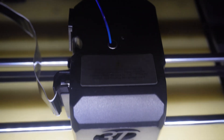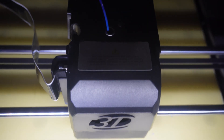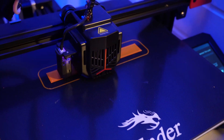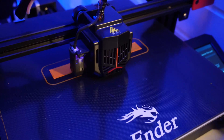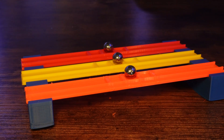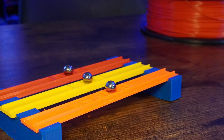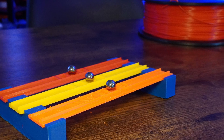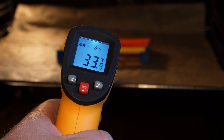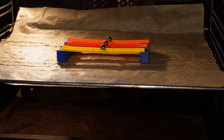And this is exactly what we are testing now. First I printed an ABS holder to put my test objects on. My test objects consist of PLA, PETG and non-post-crystallized PLA plus. They have a slight stiffening structure on the top as well as a small grid to be able to place a ball on it. Off with it in the oven. It took quite a while for the oven to get up to temperature. Test setup number one: PLA in front, behind PLA plus, and finally PETG.